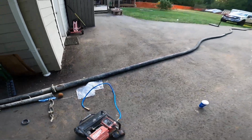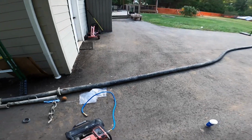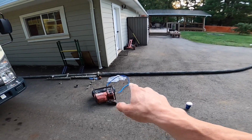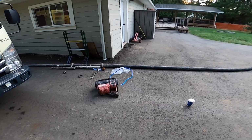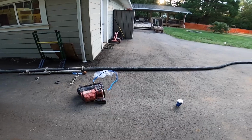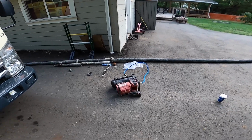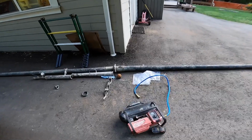We start out with the air. We're not going to exceed 50 pounds of pressure. With a regular concrete mix and anything 300 feet of hose or less, 50 pounds of pressure will and should get that concrete moving. If you're pushing shotcrete, like a dry, stiff shotcrete through lines, you may have to go higher. Don't ever, ever, ever, ever exceed 80 pounds of air to start things moving off. But for the vast majority of times you're going to do this, just use 50 as a rule. Try to keep it to 50.